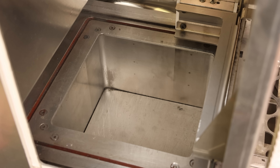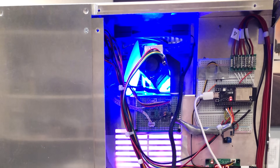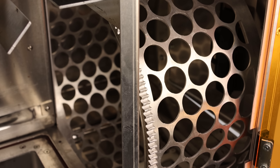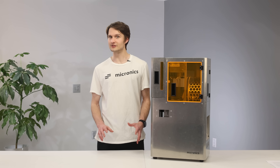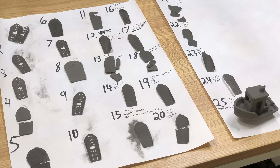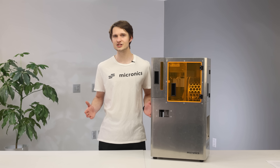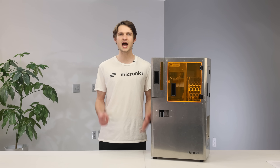We therefore quickly moved to our second prototype, which is fully enclosed. For this prototype, we opted for a more traditional design. It features a 120mm square build area, a galvo laser, and a gravity-fed powder dispenser that is fixed in place. We also integrated an internal tumbler to depowder the parts after printing. This — spoiler alert — is the first machine that was able to produce a benchy-shaped object. One issue that we quickly ran into is the spot size of the laser beam. We wanted to use a diode laser since they offer the highest watts per dollar. However, they have this one very annoying characteristic known as astigmatism, meaning the beam is wider in one direction than the other. As a result, when we tried to focus it, it would form a line instead of a round spot, which is obviously not acceptable.